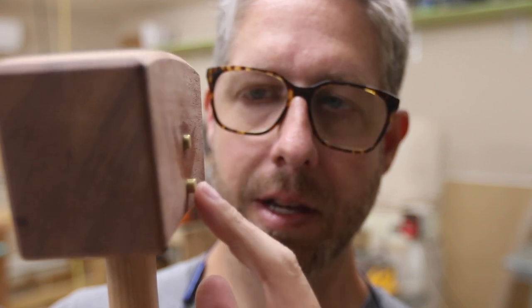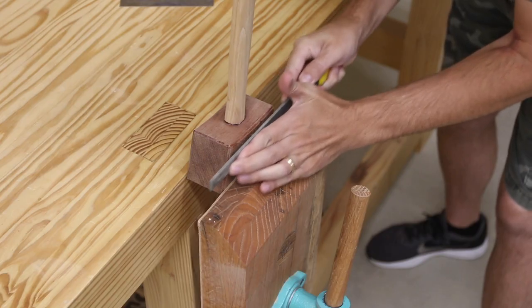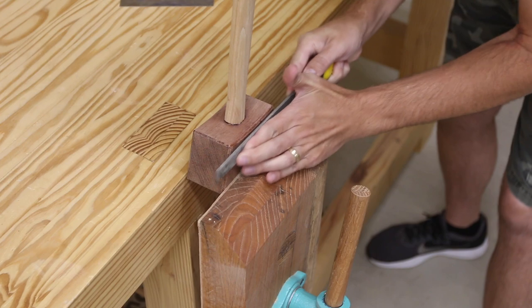All right, it's the next day. I've got the brass pins in here. You can see this bottom one is a little bit longer than the top one — I might file that down a little. I'm not quite sure how much material I need to leave out to do the pinning. I'm going to use a ball-peen hammer and a piece of steel under it and just hammer it until I mushroom that brass over. I know there's probably a fine line between how much material you need to be rounding over versus not having enough. I've never done this before, so let's give it a go.